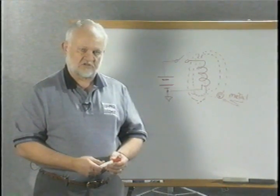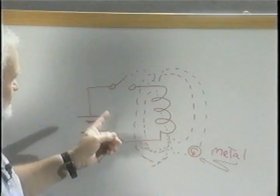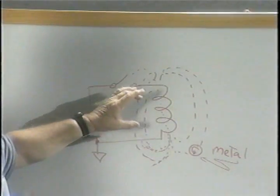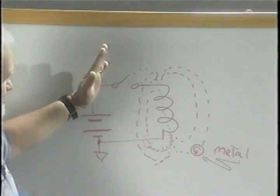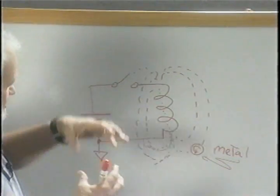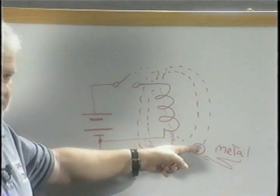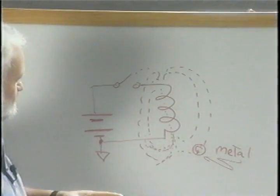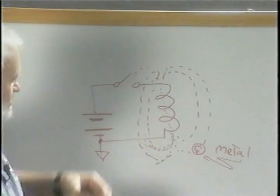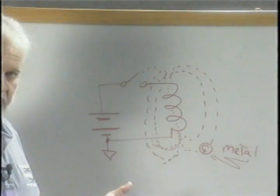The PI detectors basically work by running a current through a search coil, which establishes a large magnetic field around it. The transmit pulse closes a switch and runs a current of electricity through the search coil. After a short delay, that switch is opened up again, and the magnetic field that's been established around the coil suddenly collapses. As it collapses, any metal nearby will have additional currents induced in the surface. These currents tend to make the field collapse over a longer period of time, and this delay is measured and converted into an audio signal that you hear in the headphones.